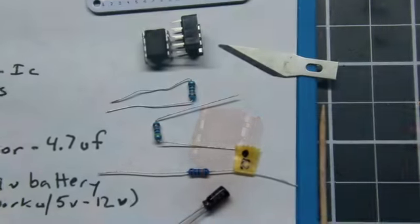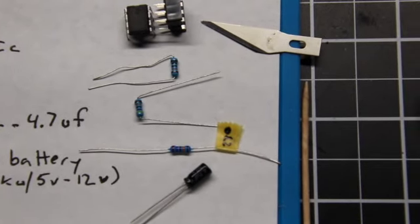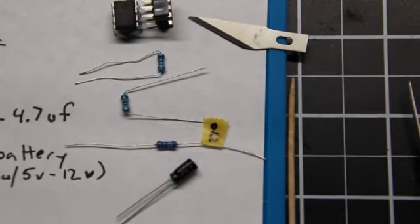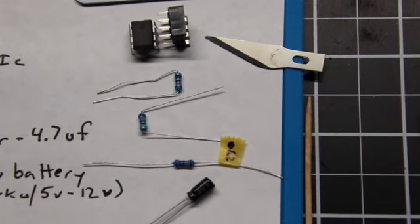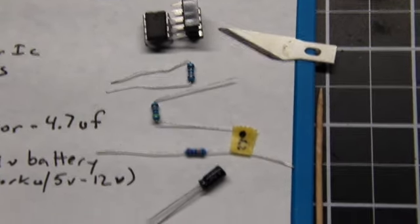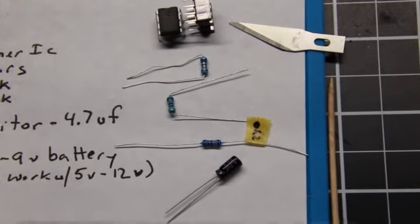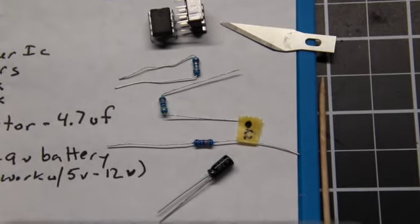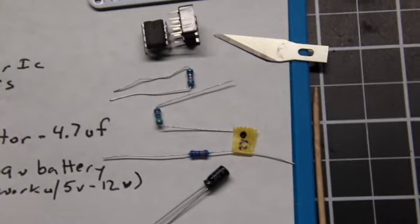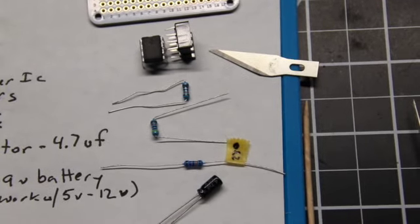Let's talk a little bit about resistors. LED lighting can usually take somewhere between about 2.5 to 3 volts. You get much more over 3.5 volts, and when you power it up, you get a bright flash and smoke. You blow your LED. Certainly at 9 volts or 12 volts, they can't take that. It's almost instantaneous. You'll get a quick millisecond of brightness and then smoke and a little bit of a smell and a dead LED. The resistor brings down the voltage to something the LED can take.